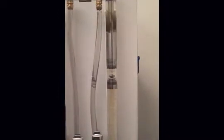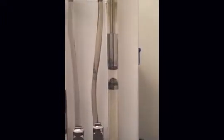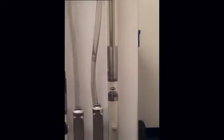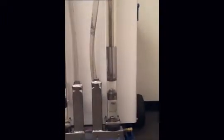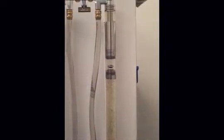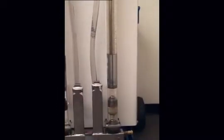Now we will listen in as we start the FAR plunger side. Notice how smooth it started, lifting the sand and flushing it back into solution without stuttering, sticking, or grinding. The FAR plunger's patented design forces the sand inside the plunger instead of between the plunger and the pump barrel wall, where it can damage the pump or get stuck.